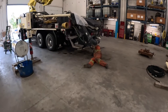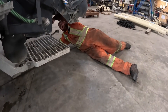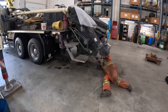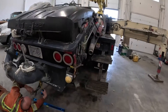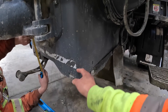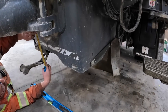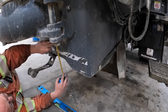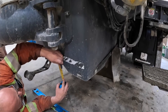What's going on — found some dude hanging out underneath the pump. Do you work here? No, I just come to hang out. He moonlights on Tuesdays. We got something cool happening here today. These hoppers — they're not new, they've been around for about ten years, but to me that's new. They have this skirt which hangs down about two inches below where it's actually welded to the body of the hopper, and it drags on everything. There's a Putzmeister update for trimming this to increase ground clearance, or approach angle if you will — something we've wanted to do here for four years and we're finally gonna get to it.